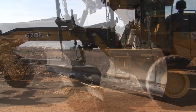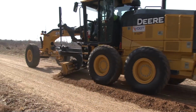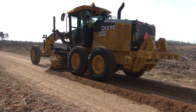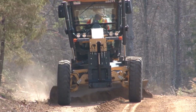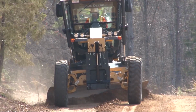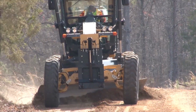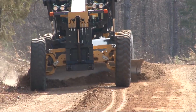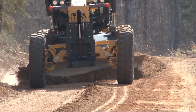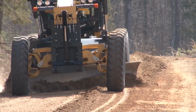As much as possible, set the angle so that your windrows are placed where you can avoid running your wheels on them as you make more passes. When the wheels roll on top of a windrow, the blade rises and falls along with the height of that windrow. Grade with the direction of traffic and keep it slow, about a brisk walking speed or a little better. Never fast enough to cause bouncing.